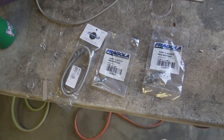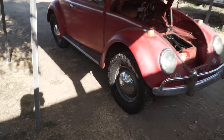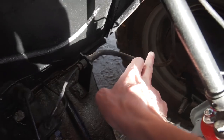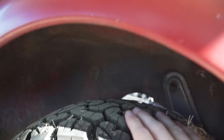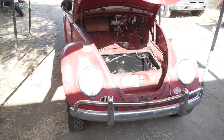Here's basically what the car looks like after our last video - all lifted and level, looking good up front. The tank is still out for obvious reasons. Here's the brake line we're replacing - female side runs down to the male side going into the drum. Steering will come off this pitman arm and go to the two spots on each spindle, so we'll have to custom make tie rods for that later. I also want to paint all this black to clean things up - I'll prep and paint it once the tire is off. So the first step is getting the car back on jack stands and then disassembling the brake system to get the new lines on.